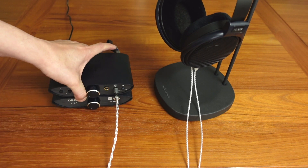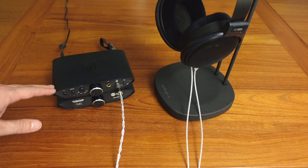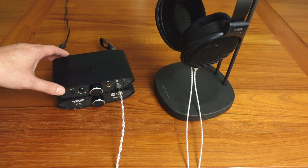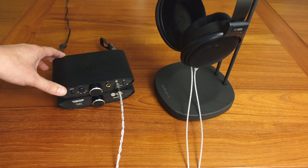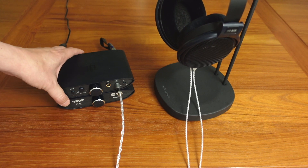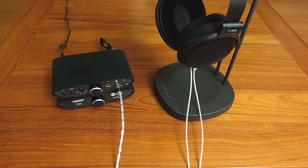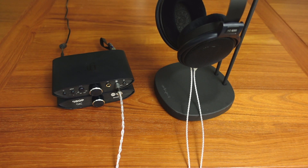You're going to see the most power out of the amplifier and the best quality by running it in balanced mode. The iFi Signature Can headphone amplifier can output a maximum of about 768 milliwatts — just under a watt — and it is optimized for the 300 ohm impedance of the Sennheiser HD 6XX headphones. When running other headphones at different impedances, you'll have less output power, and it can never exceed the 768 milliwatt maximum.